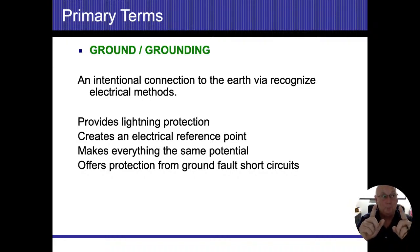So what we want to do is burn that wire up if we can't trip the breakers. Breakers are our number one priority. Trip those, turn the power off, everything's safe. If they're broken or damaged in any way, we burn that up, we break the connection, we don't allow another person to get shocked or electrocuted. We don't allow that constant flow of electricity to get heated up and put the structure on fire.